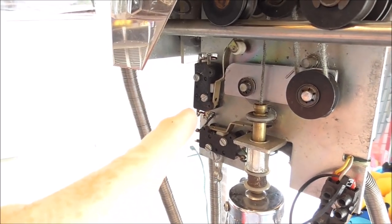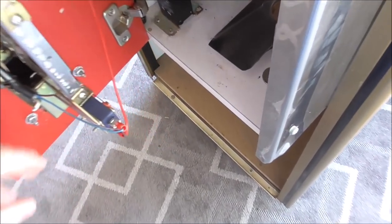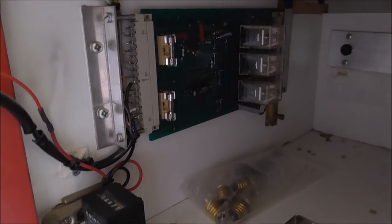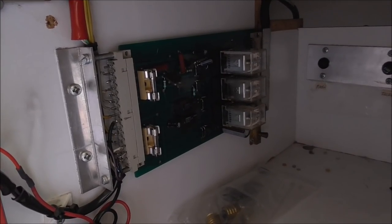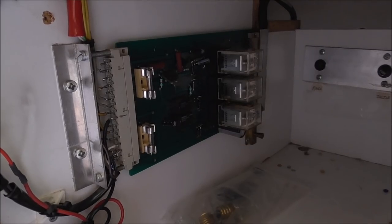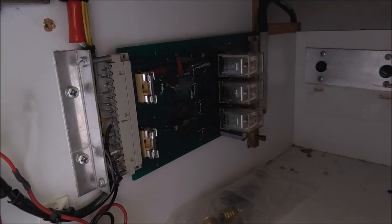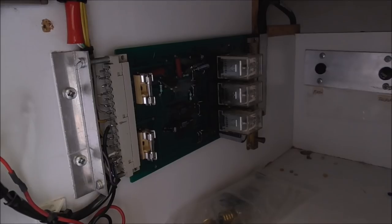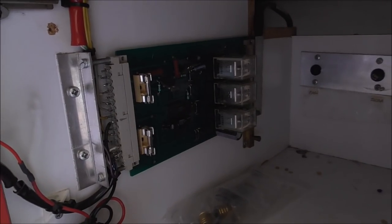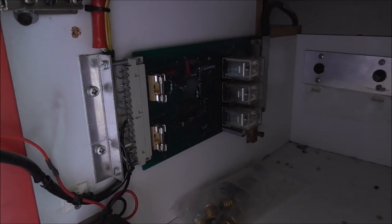if this fixes it. So we now have our 24 volts up here that we didn't have before, just from bending that, right? So since we're like that, if we hit the coin switch, we should hear our relay one come on now. And we do. But it sounds like it's not holding on, because every time I click it, it's coming on. And then when I let go, it goes off. So we about got it, but not quite. So why would it do that? The contacts in the relay are probably dirty, so we'll mess with that next.